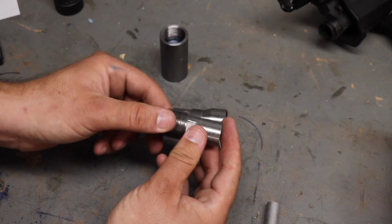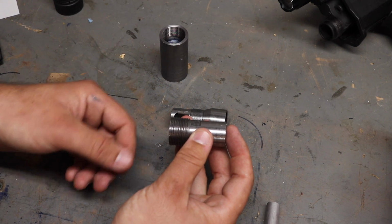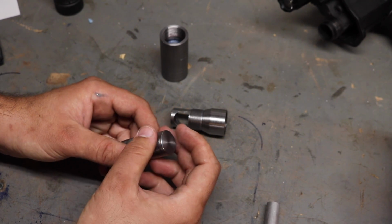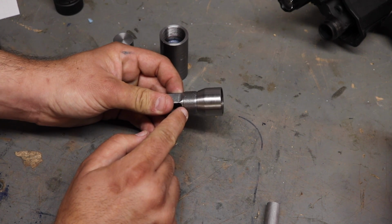But so this being a left-handed thread, I had to end up turning the workpiece backwards to keep it from backing off of this arbor, and that meant all my tooling had to be upside down. And in kind of doing stuff backwards, I got mixed up in my order of operations. Anyway, long story short, these are the threads I need left hand instead of right hand.